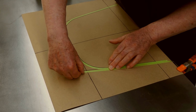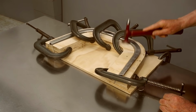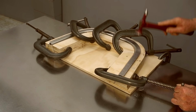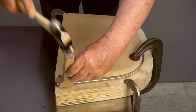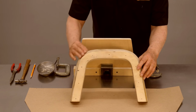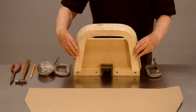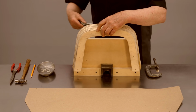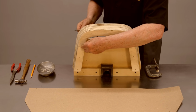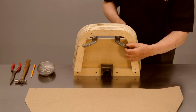In the first video, I did the layout for the dustpan and made the hammer form. This time, I'll shape the metal for the back and the side walls of the dustpan, and they have some pretty tricky contours. The inner part of the hammer form is sanded smooth, and this would be a good time to make a pattern for the piece of metal that we'll shape to fit this hammer form. So I'm going to clamp this in a convenient fixture,